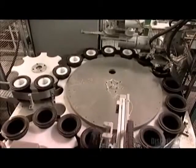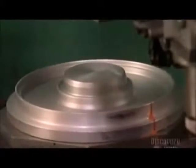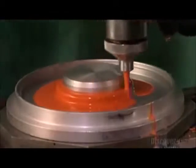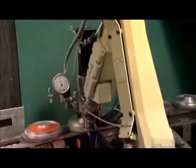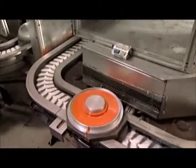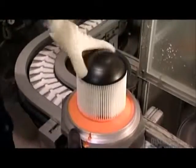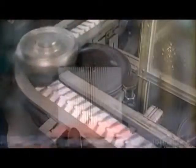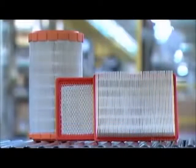The wheel pushes the paper-filled molds onto a conveyor belt, and down the line a robot pumps a polyurethane mix into the bottom mold for the filter. A worker presses the paper-filled top mold onto it. Heat triggers the chemical reaction that expands the polyurethane, encasing the bottom of the filter paper and forming a gasket that will fit tightly near an engine intake. The radial air filter is now completely assembled, and it's taken just 20 minutes.